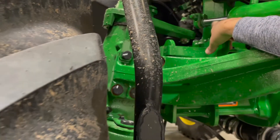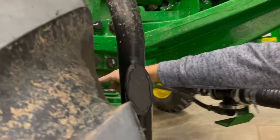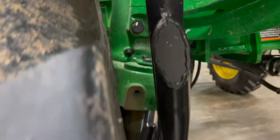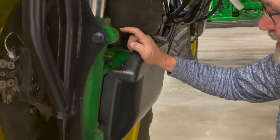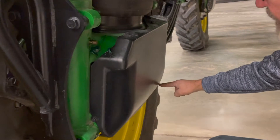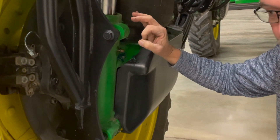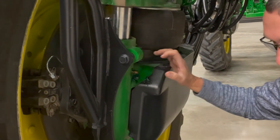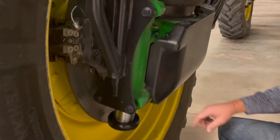The tie rods are a 100-hour service on the steering. But the ones we see get neglected are the daily ones on the spindles. On the 45s and 60s, we have four individual grease zerks on the suspension, but on the smaller ones we have a grease bank where you can get all four grease zerks at once — that's four grease zerks per wheel on front and back. That is a daily grease on the suspension.